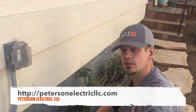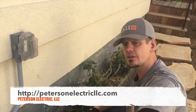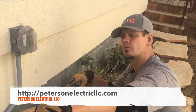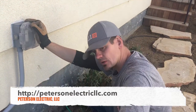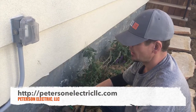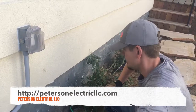With this in-use cover, we probably won't even use this outlet much, so keep these little sleeves inside so it doesn't build up as a wasp nest, then shut it and you're good to go. Adapting two-inch to three-quarter to go out 60 feet plus another 15 feet here — close to 80 feet from A to B — and we got them a dedicated circuit. I'd rather have been over at the other location, but I traced the circuit and this outlet was dedicated, so we came over here. Thanks for joining us — hopefully you got a few good hints out of this. Let me know your thoughts.